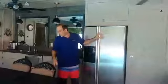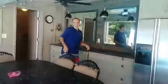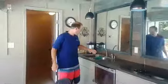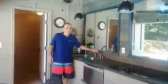So that's a way you can do a refrigerator. Other things are like sinks and cabinets. Now, when you do outdoor plumbing, like a sink like this one here, you have to think about water always draining to the lowest point. Okay, so when you're plumbing a house indoors, lots of times plumbing will go up in the wall, go over, might go down again, over again, but you can't do that if you're plumbing outdoor fixtures. You have to have everything flow down to a low point to where you can undo that and drain that.